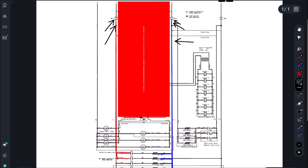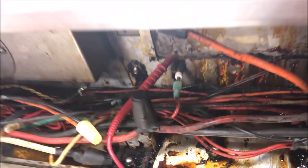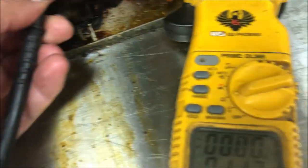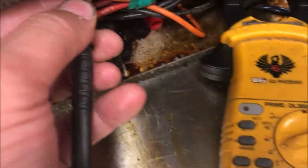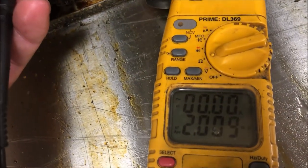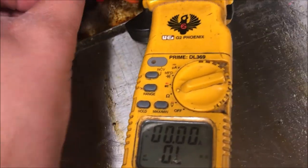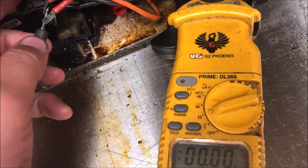On my L2 contactor there are three wires - two red and an orange. The first red, L825: we are getting 12 ohms to ground - we have a short there. Our orange wire: two megaohms - we don't have a short there. And our last wire: 19 ohms to ground. So there are two wires giving us a dead short. We've just narrowed everything down to two sections of the schematic.